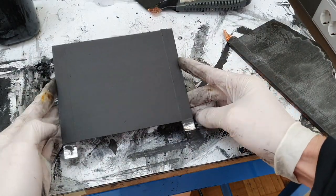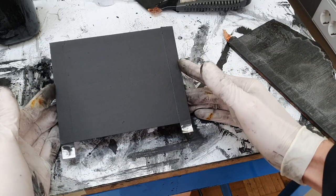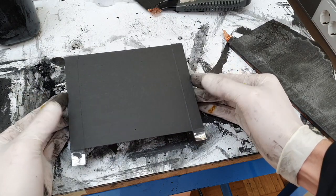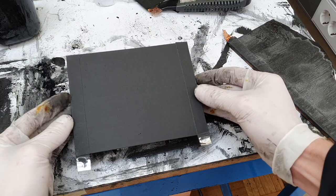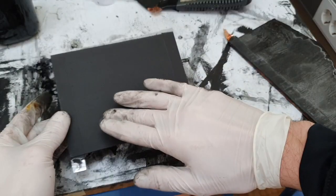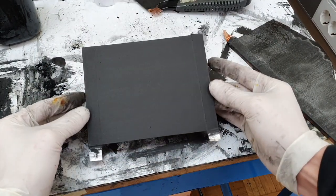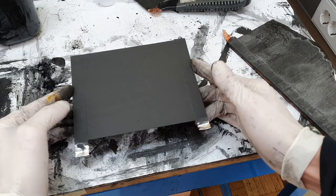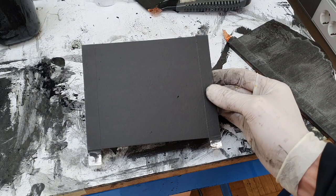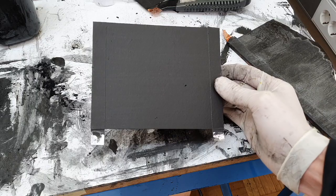Also the drying time is a little bit long, because like I said, this ink is water-based, and you need some time for this ink to fully dry. If this ink is not fully dry, you get a little bit of bubbles. So this is my prototype heater based on this conductive ink, and I will connect this heater to the Variac, and I will apply some AC current.